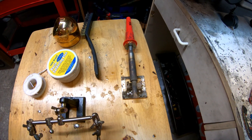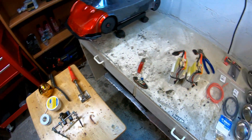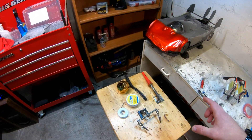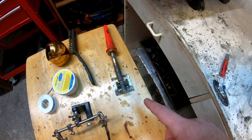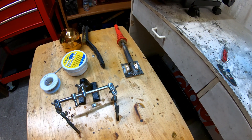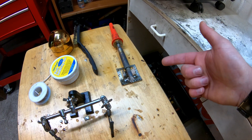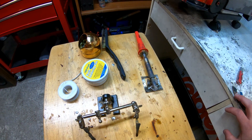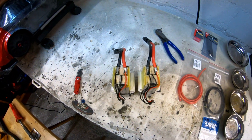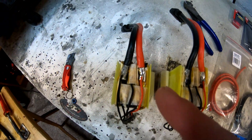It is already a stressful job. I've had the soldering iron heating for quite a long time — you don't need anything special, but I would highly suggest using a big iron like this. This is an 80-watt Weller iron, and if you go even higher, that's even better, because it holds a lot of heat. If you have it heating for 10-15 minutes, it'll solder high-gauge stuff pretty easily. For this, we want to be very, very quick about unsoldering the connections.